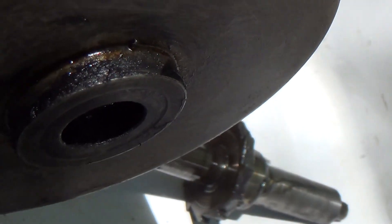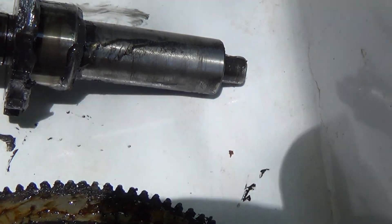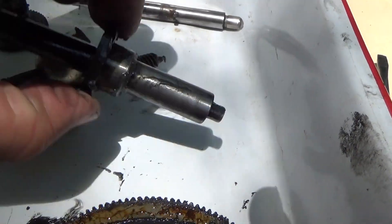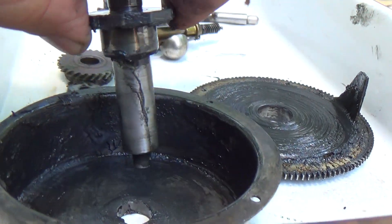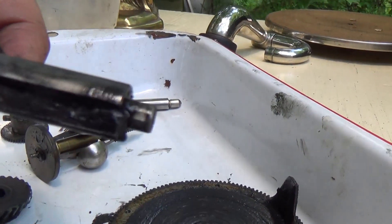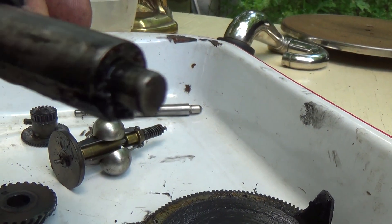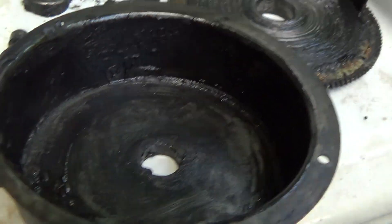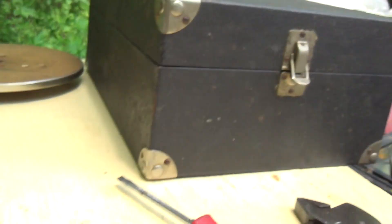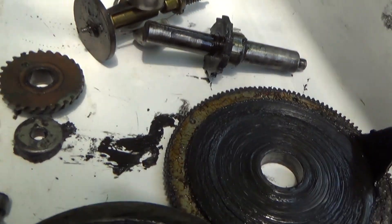That set screw — that little collar — goes on the bottom here. This shaft goes through from this side, down through there. Your spring attaches around it, and that set screw sits right on there, clamping on to that little bit coming out. If that screw gets loose, that collar falls out. This entire spring barrel crashes down into the bottom of the box, and now you have to take the whole thing apart to fix it.